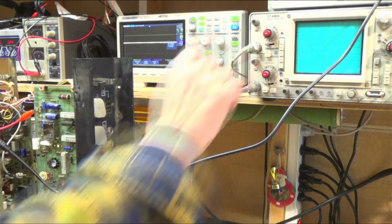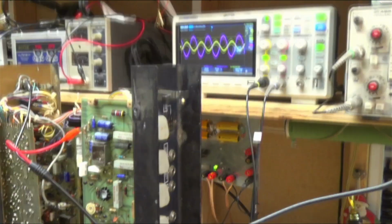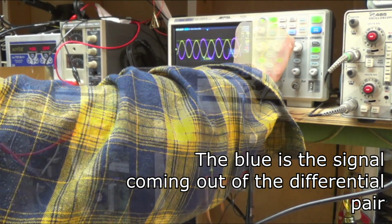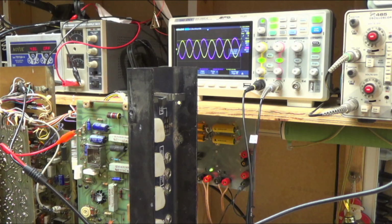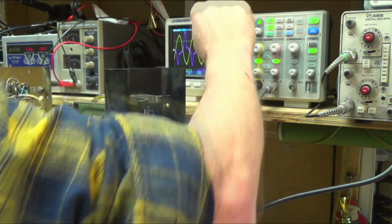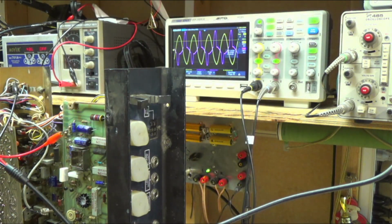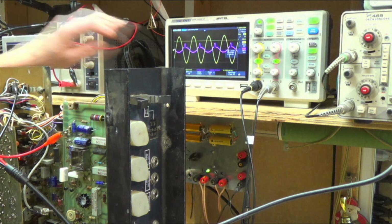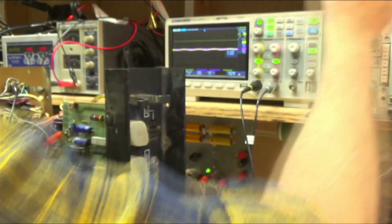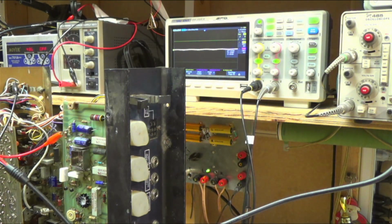Okay, I just had to take it off my dim bulb tester. So that's about 150 millivolts peak to peak. 18 watts. But that signal gets really distorted. This gets distorted. So that's 50 watts, right? I mean, it's still looking pretty good, but I don't know what's going on there. That's 24. So we're really distorted at that point.